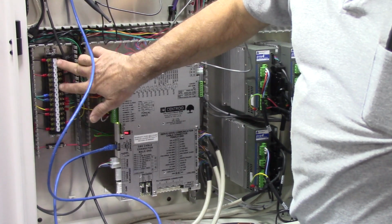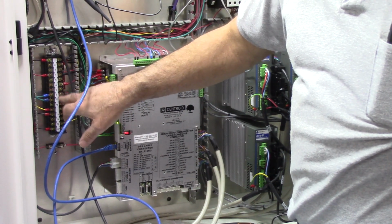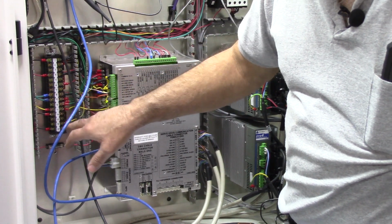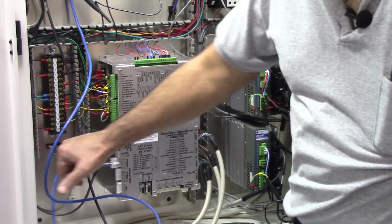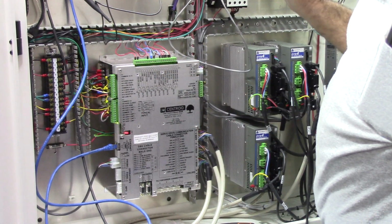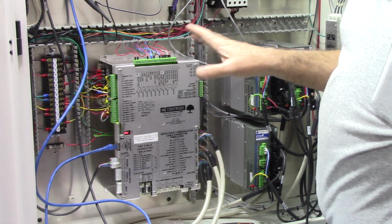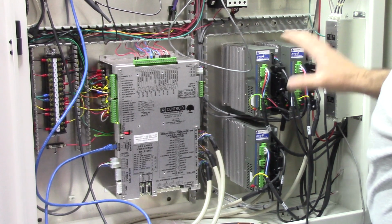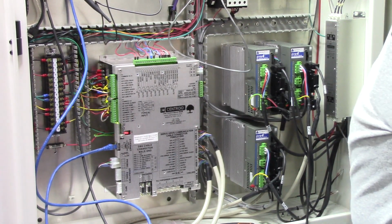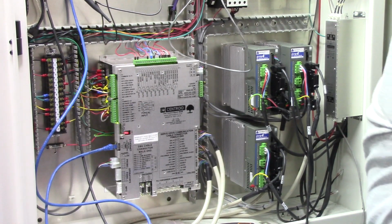So basically the upper half of this terminal block is 240 volts, then a ground, a place for the grounds, and 24 volts, and then commons down here. This little fuse is the e-stop contactor fuse. Otherwise, it's pretty straightforward. So you can tell that the cabinet itself is very simple. This cabinet has a lot of room because there was a lot of stuff in it before, and this was the original cabinet to the Fadal machine.